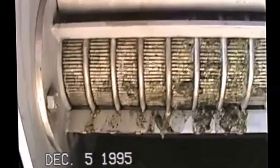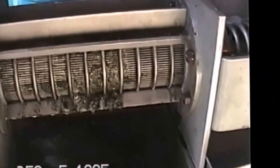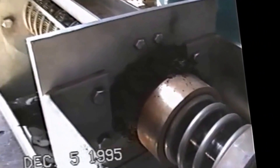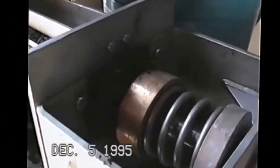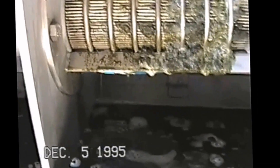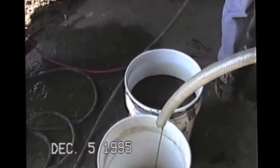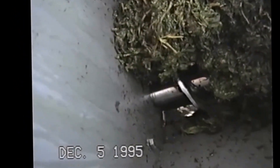There doesn't seem to be any bridging going on in the hopper — it's sucking in pretty quick. You notice the feed is much slower now. You can see now that we've got some press cake discharging around the cone. Keep filling it. You can see the press cake is continuing to discharge out around the cone. Still getting dewatering along the screen — there's quite a bit of solids coming out with the press liquor. So far we've got about three gallons of press liquor in one bucket and we've just switched over to another bucket.